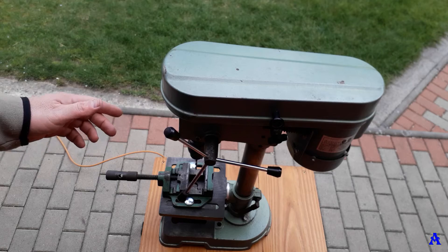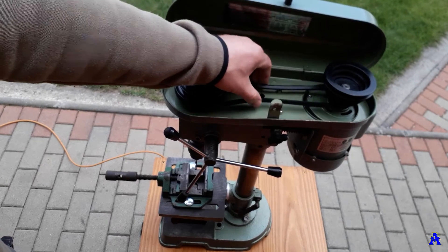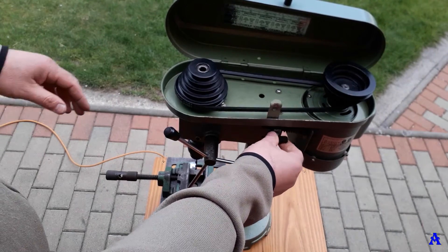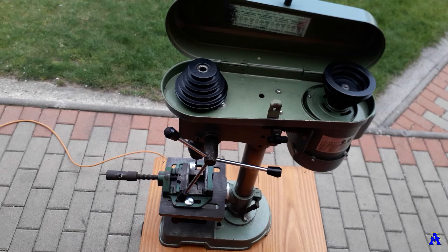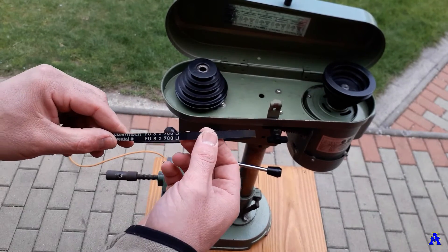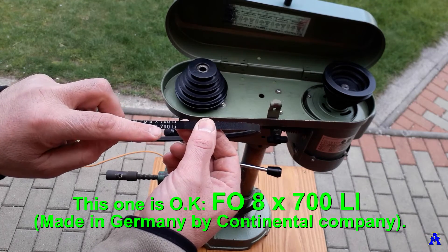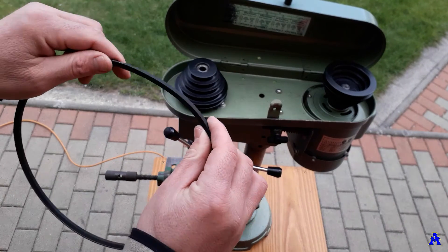You can see that it works, but for the machine to work properly the belt has to be properly tightened. So I checked the internet again and got the smaller size. The new belt is made in Germany by the company Continental, and it did cost me roughly 10 euro. The size is F08 — profile 8 by 8 millimeters — by 700 LE, so the inner length is 700 millimeters. You can see that even the finish of this rubber is way better.